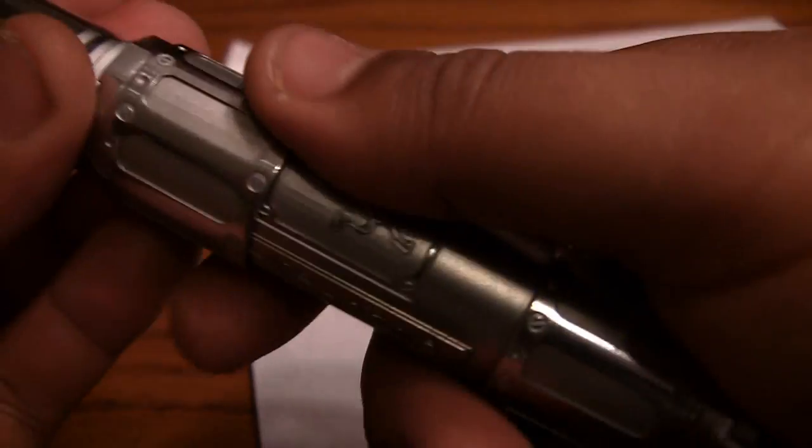At 1.1 ohm, the V3tronics flip did 0.28 voltage drop. And at 0.35 it did 0.67. 0.67 at 0.35 ohms. And that was the V3tronics flip. A little bit of voltage drop. I still love her though. Alright, on to the next one.